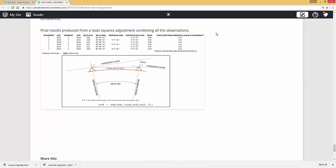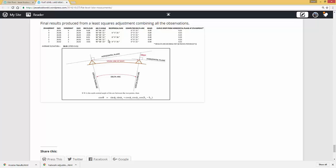Here are the final results tabulated. The standpoint is from each stake, the foresight is the stake I'm measuring to. I'm showing the elevation at one stake versus the other and the delta elevation. Ideally we'd like that column to be zero, but I'm reporting exactly the results I got. I'm happy to say I was able to keep all of this within a half an inch — four hundredths of a foot. Most of them are definitely at the eighth-inch level, so the worst case has everything sandwiched inside a half an inch, which is pretty good.